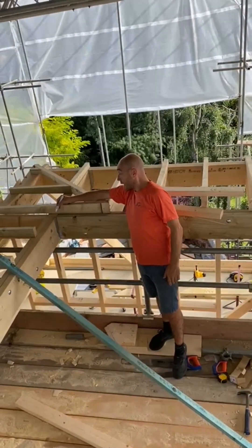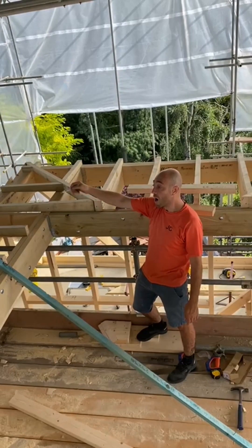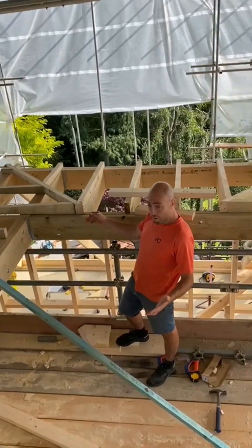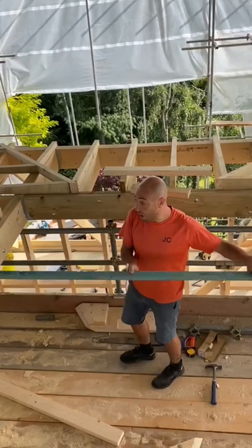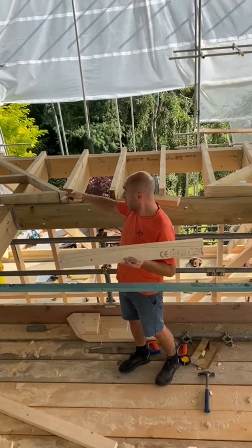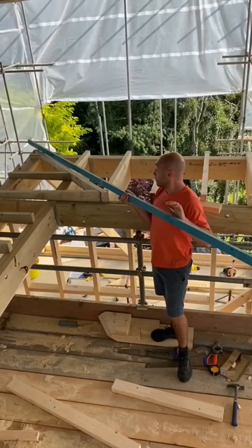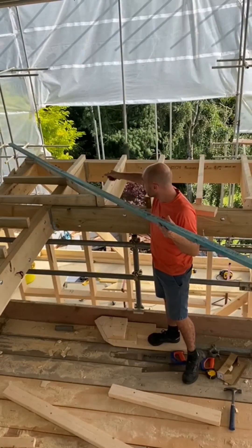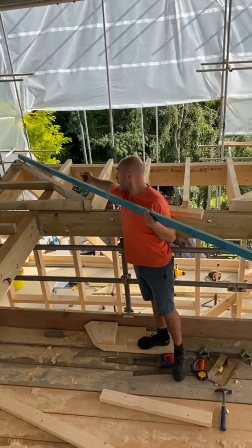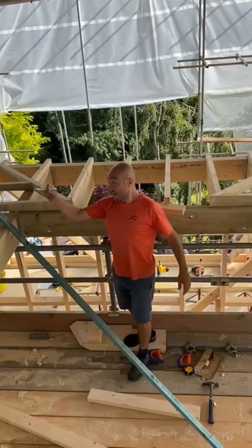There are a couple of ways you can do this. You can work to the corner, put your fascia piece in from the corner and work away. I like to work it as a 45 — half my overlap, half out, like I would if it was a hip roof. That way they go where they go. Instead of getting fascia pieces and cutting them all with a lot of waste, on the centre point I will cut one, put it where it needs to go — half my overlap each side. Once I've got that, I can put this in line of where it's got to go to the centre. When I know where that's going, I can use an offcut of timber, hold it at that very end to my highest point, mark on my timber and cut that. Once I've got that hip in, all my timbers will just go off that point, I've got my angles and measurements and that'll do the size.